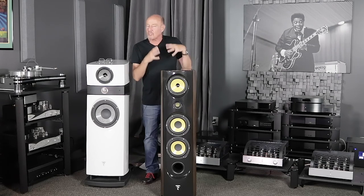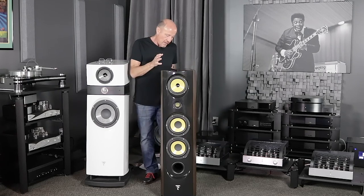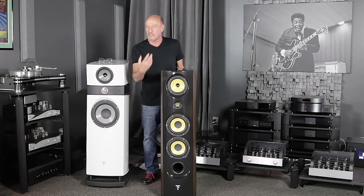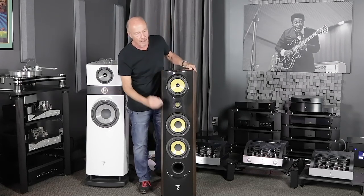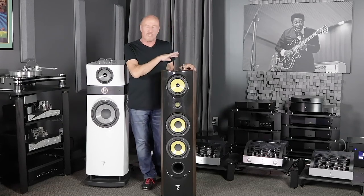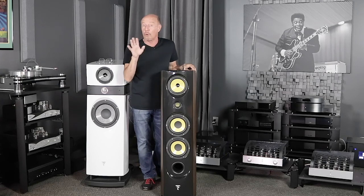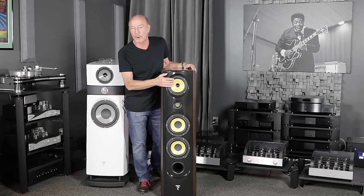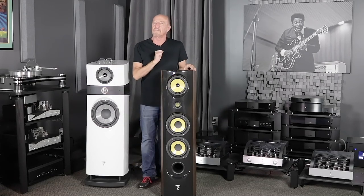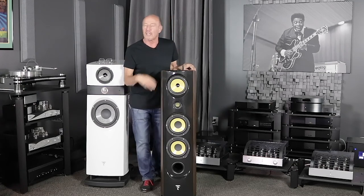It's a big cabinet — you need a big cabinet to get bass response. That's why I have it next to the Scala Utopia. It has a port on the front and a port on the back, which keeps the efficiency up and gives you that nice round bottom end everybody loves. They're using Kevlar. Focal has been famous for using Kevlar for many, many years — they were the company that really started the whole thing. If you look at high-end car systems with yellow cones, that's going to be a Focal system. This is the latest iteration of their take on Kevlar, and the benefit of these new drivers is speed, less mass, increased stiffness.